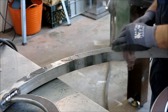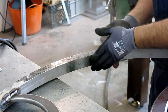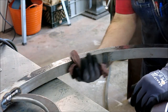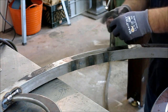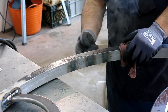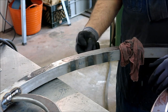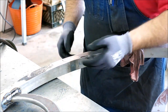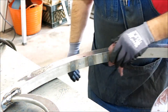Alright, so we'll get those cooled off nicely. You don't want to take any measurements until you can basically keep your hand on it without lifting it. Otherwise, you can get false readings when you go back to check. So we'll see if we improve this thing. The idea here is this was minus 15 thousandths, something like that, meaning it was in 15 thousandths.